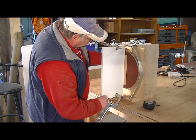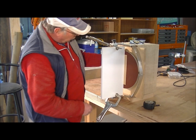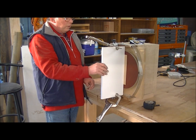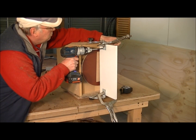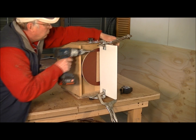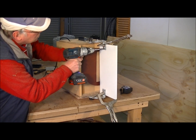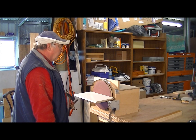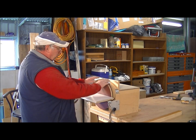I've got a piece of MDF 3mm board in between the disc and the edge face of the staging, and I've clamped the stage into the bracket, so now I can pre-drill it and I know everything's going to be square. And there it is — it's pretty well a finished unit. I'm leaving these corners on here; I was originally going to cut them off to the shape of this.